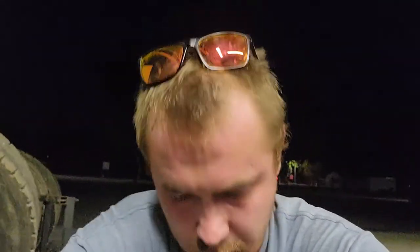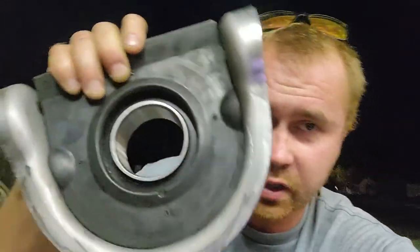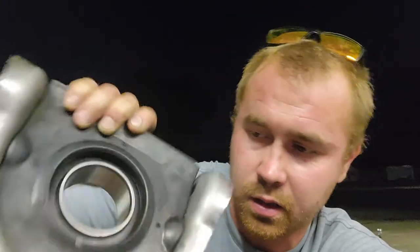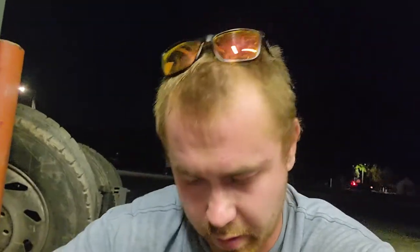In our application on a detach, when you're back underneath the trailer, something needs to take the force because you're stalling out the drive shaft, and this guy right here takes all the abuse. So it's nice to have a solid rubber — that way when the drive shaft engages it has a give, but not much, and it won't sag as much. The only downside is they're a little bit rougher than the regular ones.